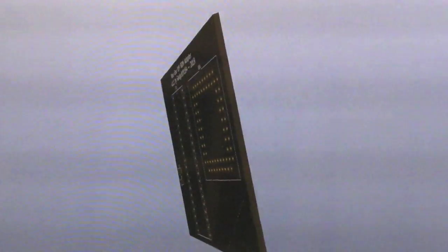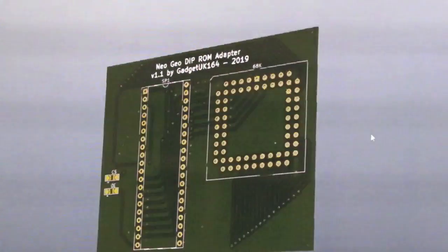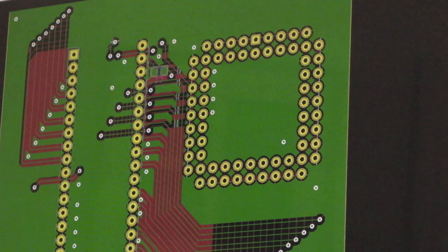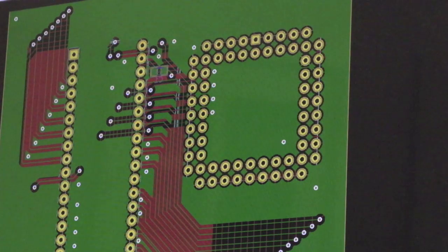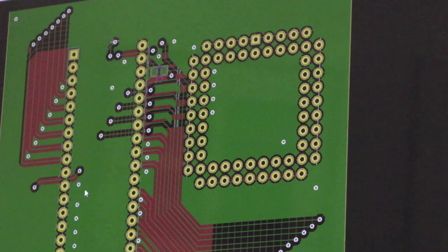So it's useful occasionally just to come in here and check, just to make sure that where you've got wires going through to stitch the grounds, you've not accidentally joined up somewhere else. And the other aspect, when you want to stitch the ground planes, is to just swap between the layers here. So if you're looking at, say, let's say that one there, I don't know if you can see where the cursor is. If I just switch layers, you can see what's underneath. It's just solid green, it's solid copper. So it's quite easy to go, okay, I can position one there, then just choose the via component, plop, done. And then maybe flip again just to make sure it's in the right spot.